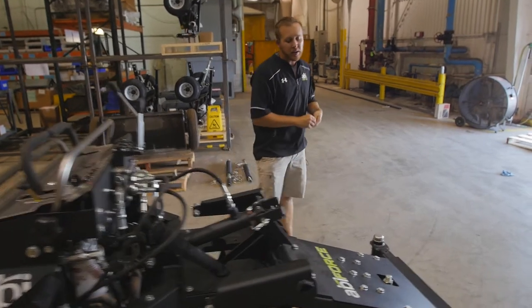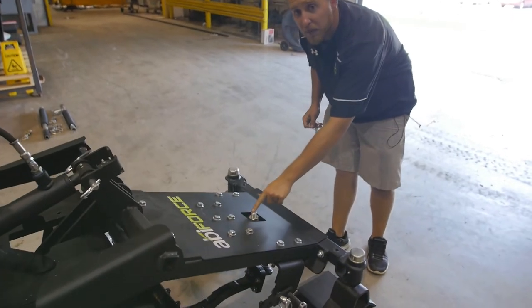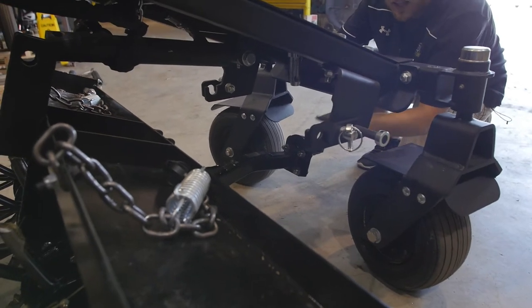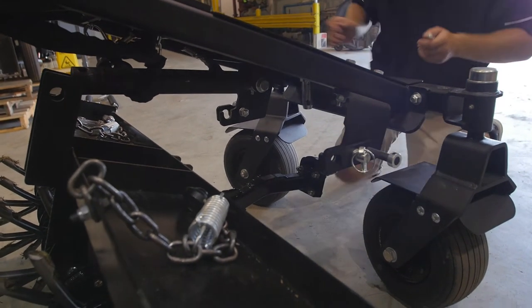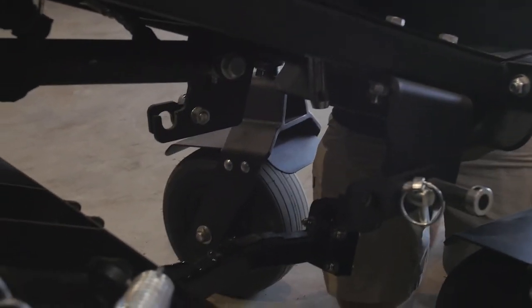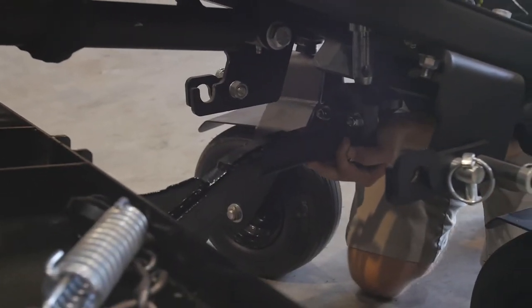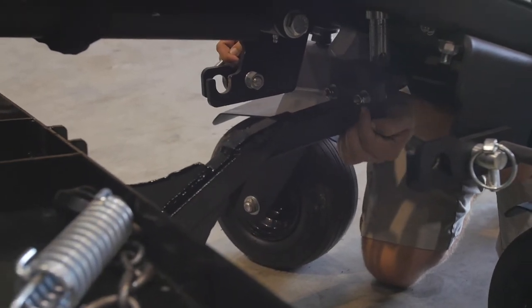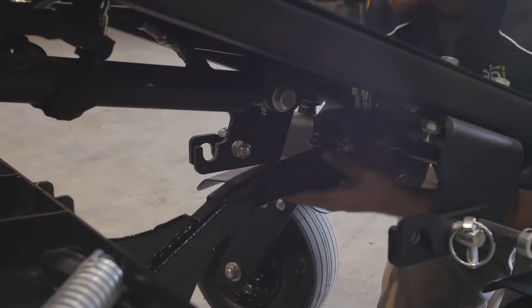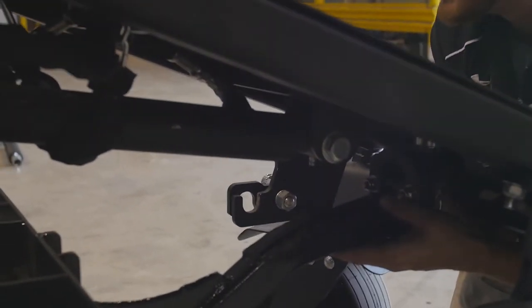We're now gonna grab your linch pin and we're going to lift the ball joint up into place. If you look on the bottom of this bolt here, there's actually a pin that trunnion will slide right over. So I'm gonna go ahead and lift that up into play. Different ways to do it, either a pallet jack's a good idea, something to be able to get some leverage. I'm gonna go ahead and just try to lift it up. The aerator does move a little bit, so it shouldn't be too bad. Recommend doing this on some flat ground. There we go. Up through, and then pin the linch through that.